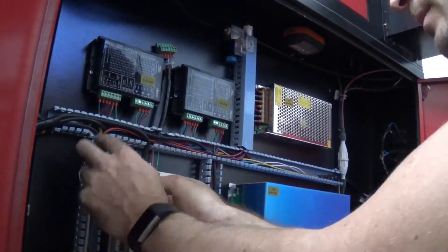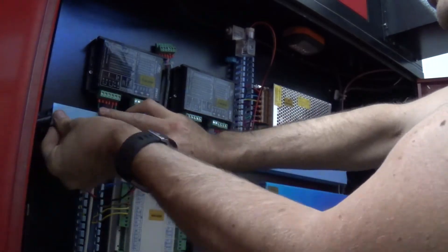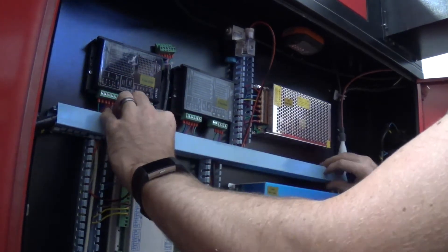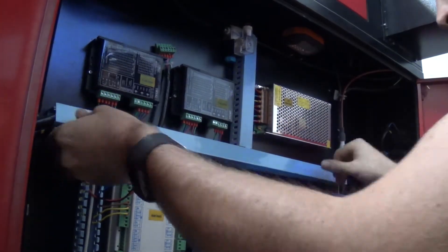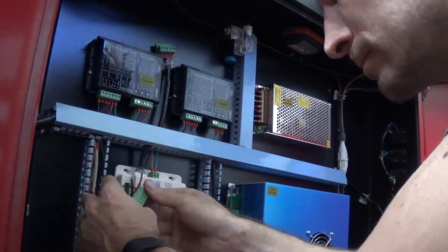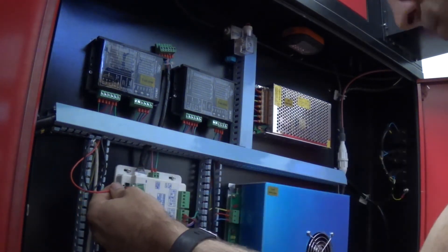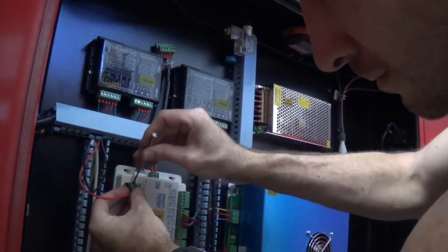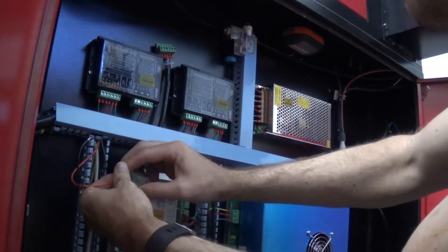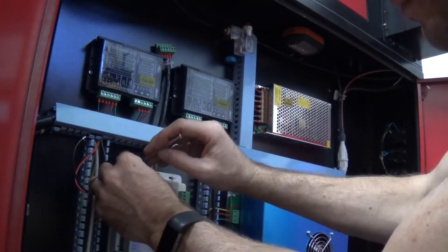I'll expose some of the wire so I can mount it in the terminals. Like I said, red is going to go to the plus 24 volts on the controller — I believe it's terminal 6; there are already some brown wires there. The black wire is going to go to the wind terminal, which is terminal number 5 on my board. Yours might be different, but it's wind and plus 24. In the laser software — which for me is LightBurn — under parameters I get to decide whether or not wind is turned on or off for each layer profile, so any layers that have wind set to yes will automatically turn on the air supply line to the laser cutter head.